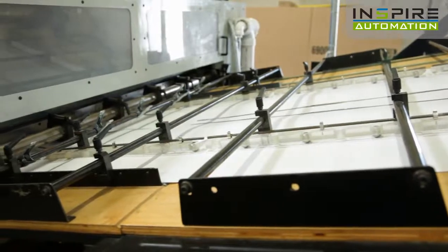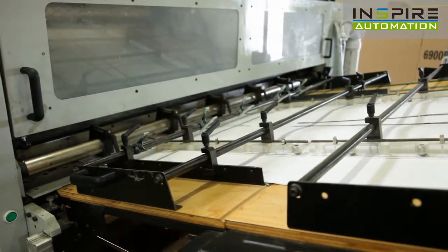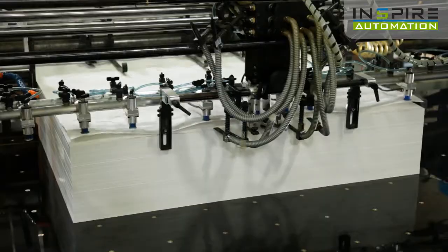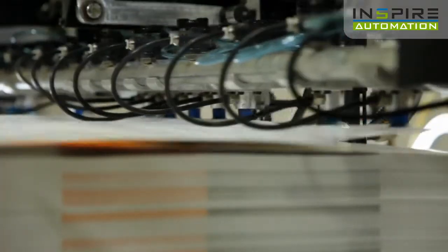The standard Automax will feed up to 152-inch boards with an option to feed beyond 200 inches. The Automax has a top speed of 6,000 an hour and applies the adhesive electrostatically. Independent suction valves on the trail edge of the litho feeder, along with a steady stream of air, provide consistent feeding of the litho sheets. It too can handle an 8 by 6 inch label all the way up to 82 by 65 inch labels.